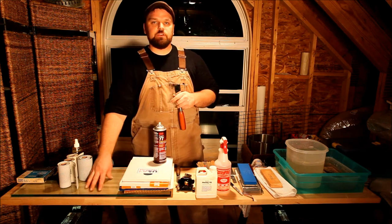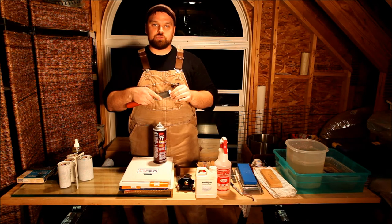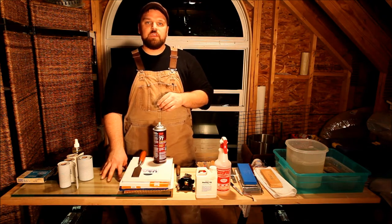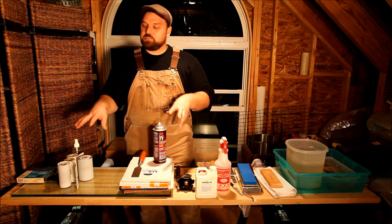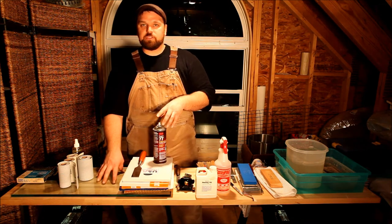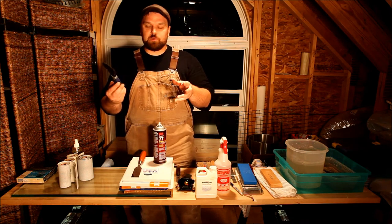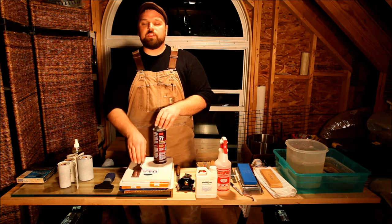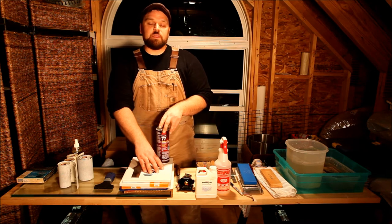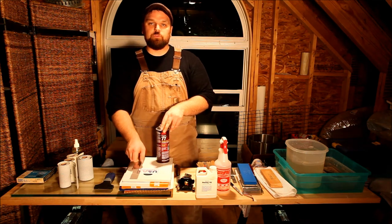Once you've adhered the sandpaper to the surface — the same goes for the rest of these techniques — you flatten your back, flatten your bevel, and then work on your sharp surface. The sandpaper technique is easy because you only need one piece of glass with several abrasives. It's easily transportable. You adhere the sandpaper to the surface and scrape it off with a window scraper from Lowe's. It will quickly abrade the metal since a lot of this wet/dry sandpaper is intended for sanding metal, so it works really well, giving a very polished surface on almost all tools.